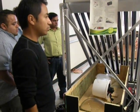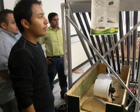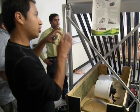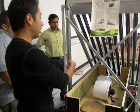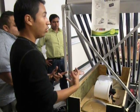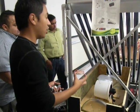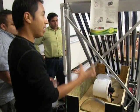It's possible that ours has a higher pressure drop because of the structural difference. In the commercial case, the desiccant material is thick and held in a honeycomb structure. We're thinking of doing some other designs — probably putting some fiber in there so that it holds the desiccant and spreads it out — but we still have the problem that when we rotate the wheel, the desiccant material might shift.